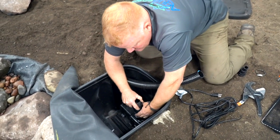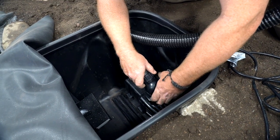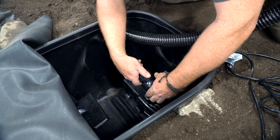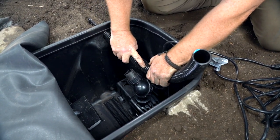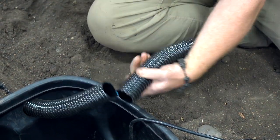The other thing I've done is got the discharge area of the pump up against the left side of the skimmer because I'm bringing my pipe in from there — that gives me a little more real estate to play with the pipe. Now I want to position this ball joint to accept this pipe. I really like that angle; I'm kind of at a 45. Once I've got that lined up the way I want the pipe to come in, I can accurately measure where to cut, which is about right there. You can take your razor blade and effortlessly cut this.